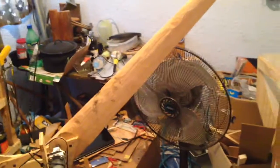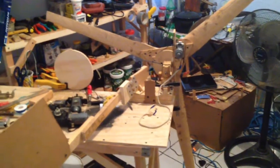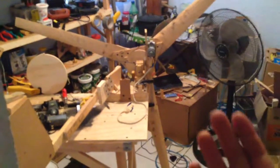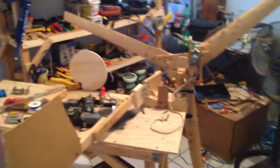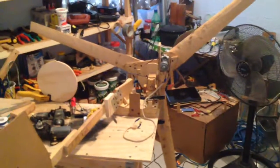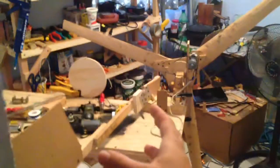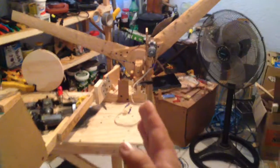You can build a wind turbine and probably produce about 100 watts from this one, and it only costs less than $10. I'm really happy with how easy it was to make the furling. It's great because it protects the wind turbine — the turbine operates up to a maximum speed, and you don't want to build it for 100-kilometer winds, because that rarely happens. So you build the furling to protect it at high winds.